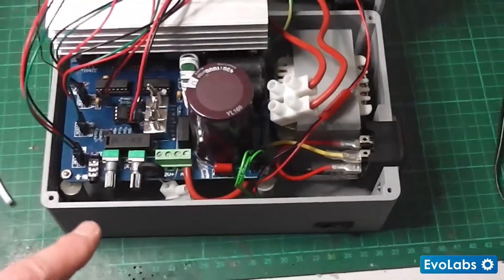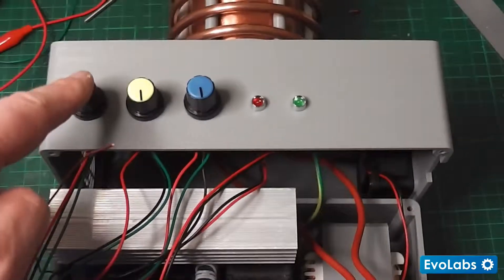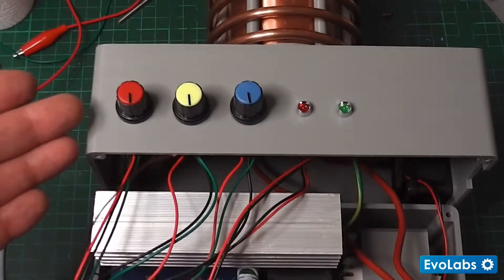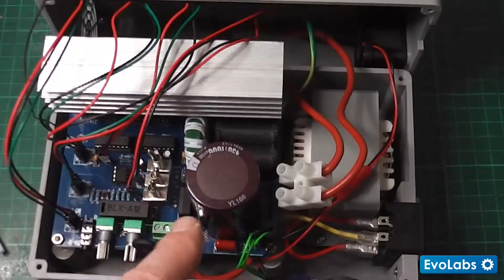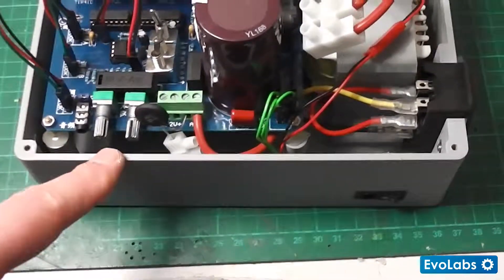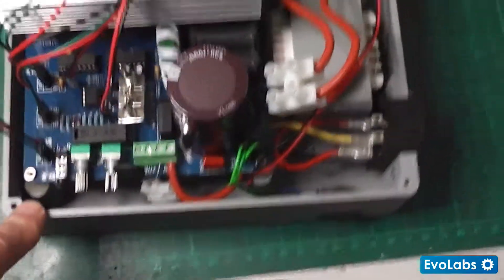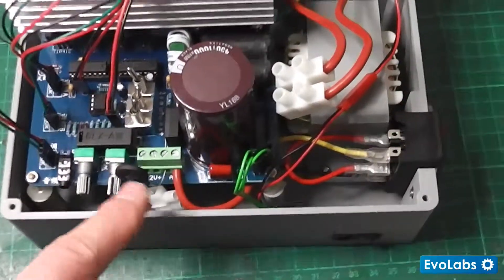In retrospect, this isn't the best design for the case, because I've got it in two roughly equal halves where I have the pots, the LEDs, and the fan on the top. This means I need these long wires that are long enough to have the lid on its side so I can actually plug everything in before lifting it on top of the base. A better idea probably would have been to have the base close to full height and just have the lid as an inset to the bottom case, so I could have all the pots and LEDs on the base and not worry about the long leads.